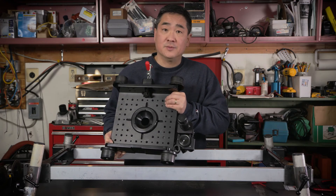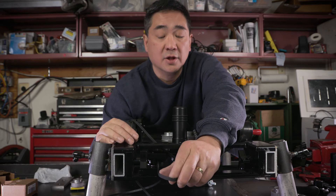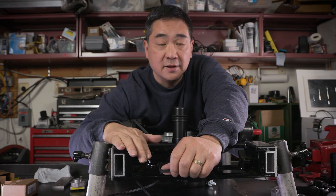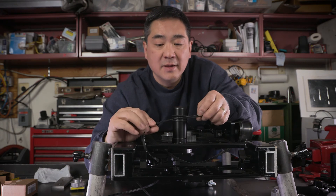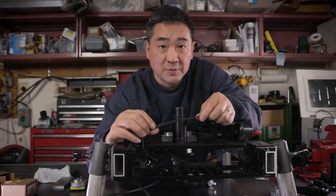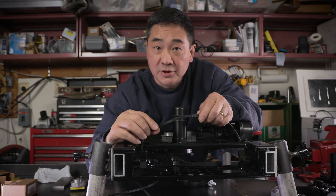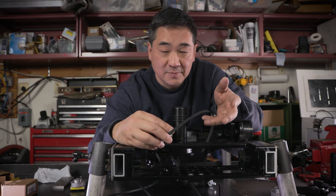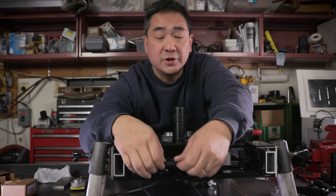Mounting this motor to my sled was actually pretty easy because the Kessler shuttle is similar in size and weight to mine. We need to secure this timing belt right about here at the rail support end of the slider. The timing belt is actually a standard industrial piece — it's an XL series belt. I did buy it from Kessler Crane since this was my first experience with these timing belts, but it turns out it's just a standard piece you can order by the foot from McMaster-Carr. For prototyping and one-off projects, I always try to use off-the-shelf parts because they're more frugal and always available.